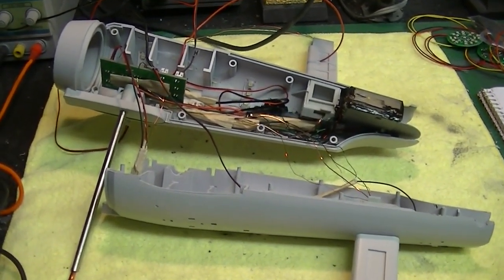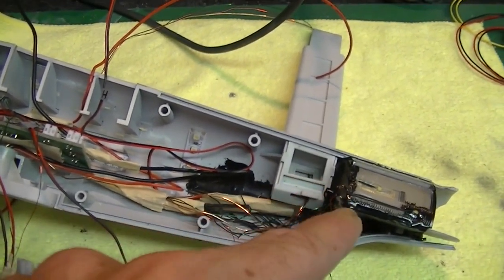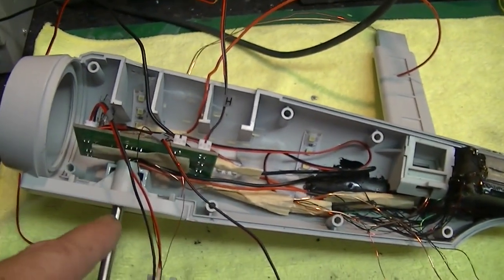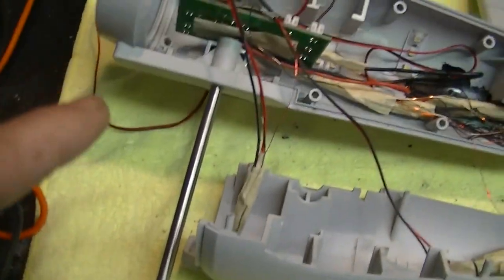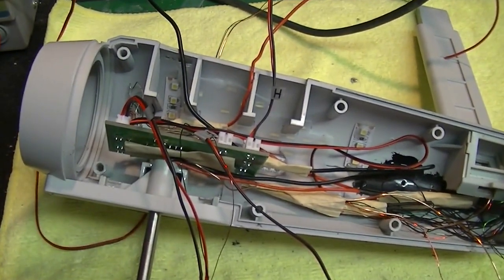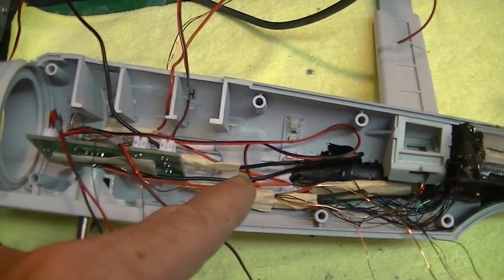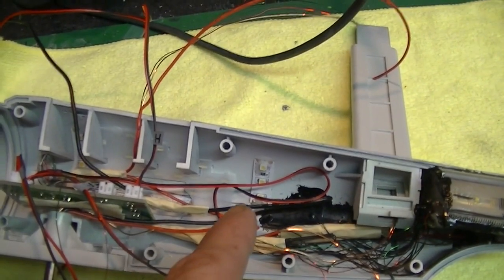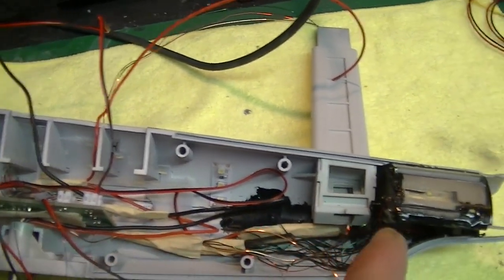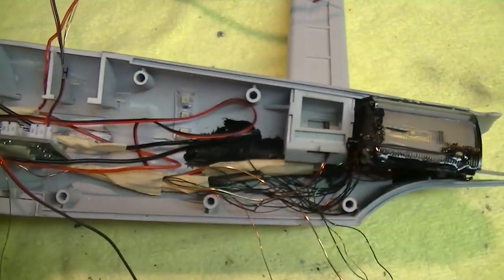I'm back and we're just about ready to seal up the secondary hull. I've got the control board for the primary hull in place, which runs the ion flashing lights at the back and the two flashers inside the shuttle bay. We've got our trigger wire for the Bussard speed control, and the wires run up through the pylons to power the Bussard lighting — done on both sides. The mounting rod is in place, so once it's all together we can put it up on the stand. Power comes in, connects to the board, then to the main lighting — a simple continuous plus-to-minus circuit, with each light strip wired individually so a break in one doesn't kill the others.